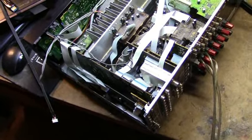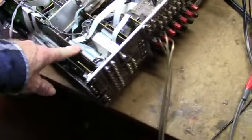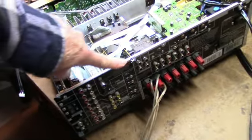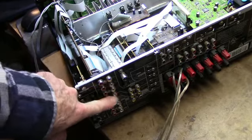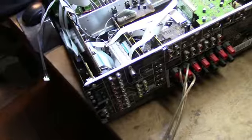Well, this is going to be easy — I was going to pull the board out, clean the contacts, put it back. But luckily for all of us that work on these things, the engineers at Pioneer decided that you'd have to pull the back panel off to pull the panels out. You've got the input connectors here protruding through the back — you can't get the panel out without removing the back.